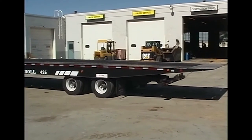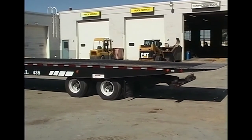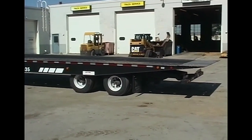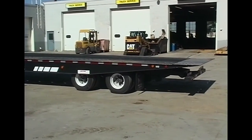When parking a trailer, make sure the undercarriage is not forward of transport position. To provide Department of Transportation approved underride protection, the undercarriage needs to be back as far as it will go with the undercarriage rollers fully seated in the roller pockets.